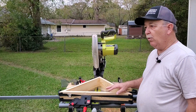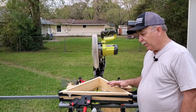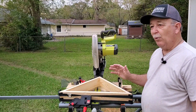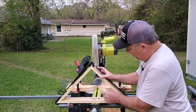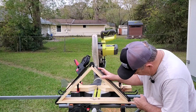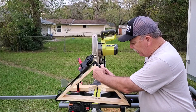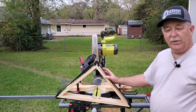These were proving to be tough, so I decided rather than messing up the cherry I'm going to make this out of, I'd get some pine and play with it. This is the third board I bought to do it, but I finally got it figured out. As you can see, I've got real nice 45-degree corners here — pardon the finger, that's what happens when you hit the wrong nail with a hammer. I've got a good 22 and a half degree here, 22 and a half here, and a 45-degree here, so it works out perfectly. This gives us a 90-degree inside, 45-degree corners, which is what we need for the perfect dimensions of the flag holder.